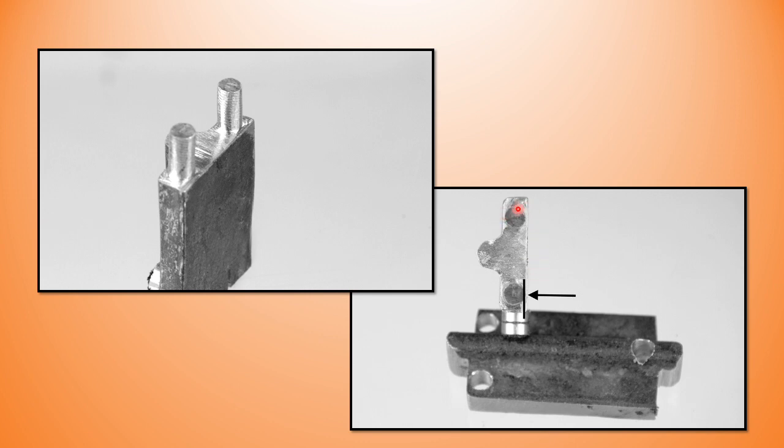So I don't need this shoulder at the back. So let's get rid of this. Let's move this tenon across to the back so that the back side of the tenon is in line with the back of the back strap of the collar, and that's going to give me a much heavier shoulder here, which is going to move my drill hole for the mortise further inboard of the collaring stock.